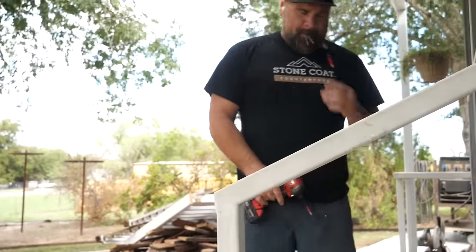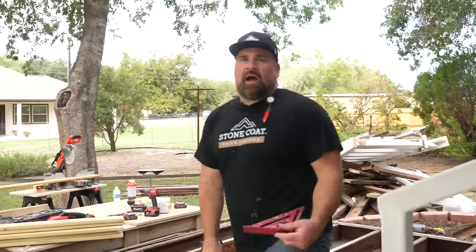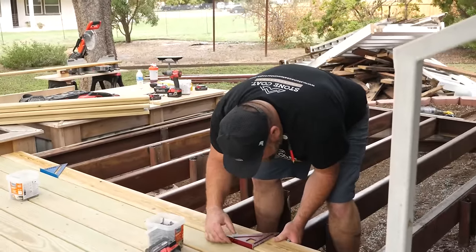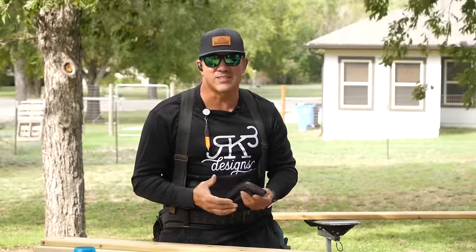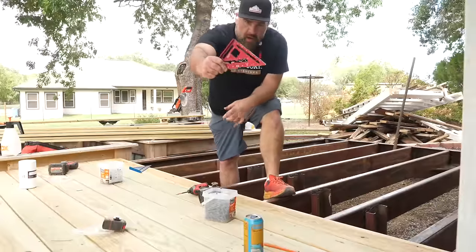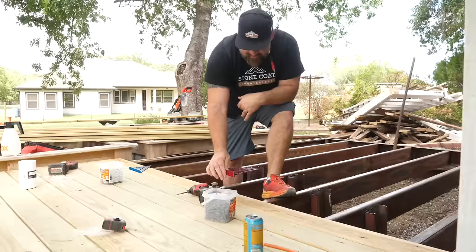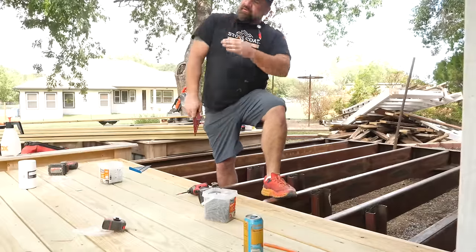Working to a wide variety of music — Snoop Dogg, Beastie Boys, Limp Bizkit, Cypress Hill. Just having fun out here. Using a framing square for decking — we've got our screw spread marks right on the square. We'll use it as a spacer so we know exactly where to put our screws, and it lines them up so when you look at those screws, it looks great.